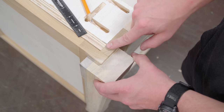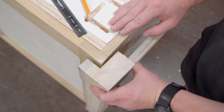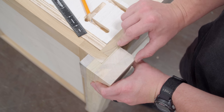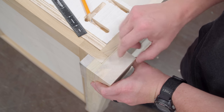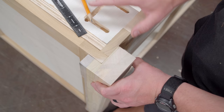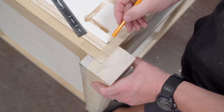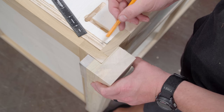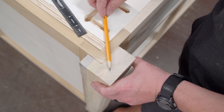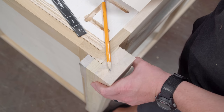The legs are supposed to be the same height as the cabinet. My floor is not level, so that's why there are some height discrepancies. I'm going to reference everything off of the top. As the leg goes in place, I'll use glue in the joint to secure it, and if I can get clamps on it to isolate the movement, I'll prefer clamps. If not, I'll shoot some brad nails on the outside — fewer holes to patch is better. Once it's locked into position, I'll secure it with screws through the corner of the cabinet at about 45 degrees to get the meat of the leg, probably three screws per corner leg.